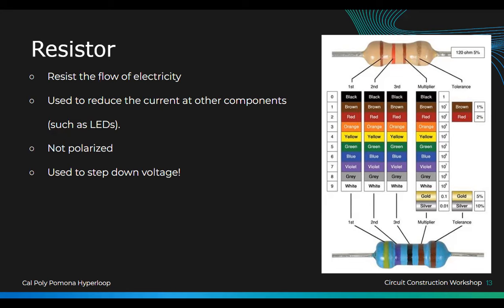So let's pretend your setting is 200. You'll see a 1 on your multimeter. That means your range is way too low; your resistance value is a lot higher than what you're trying to measure. So we go up to 2000, and it's still way too high, still showing the 1. So we go to 20K, and now we can see about 10K. 9 point something using 20,000 as our range is probably our 10K. That's how you use the ohm meter.